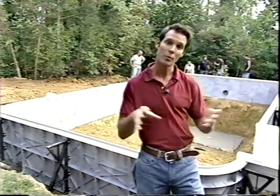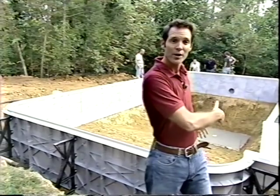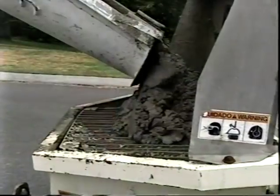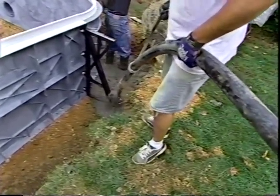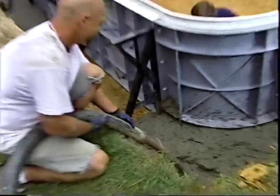There are several ways to pour concrete into the pool. The most labor-intensive is using a wheelbarrow in small increments. Alternatively, a concrete truck could back in and pour directly. For this project — to avoid messing up the landscaping — a concrete truck is left on the street and all concrete is pumped through a hose into the pool area. This works like a garden hose, gets material exactly where needed, and when done, you can't even tell the truck was there.